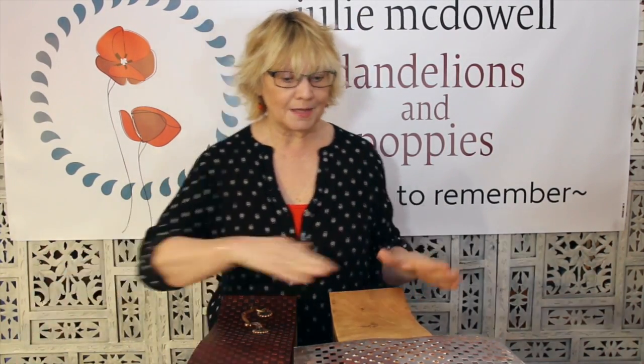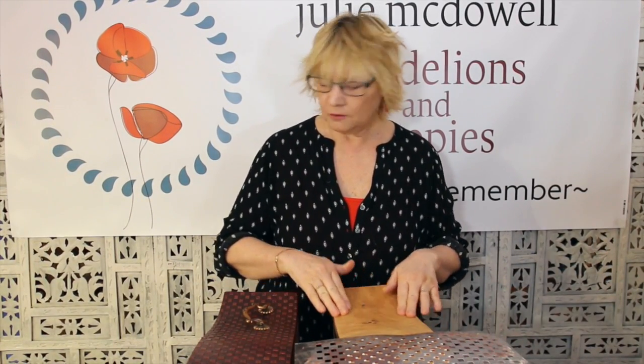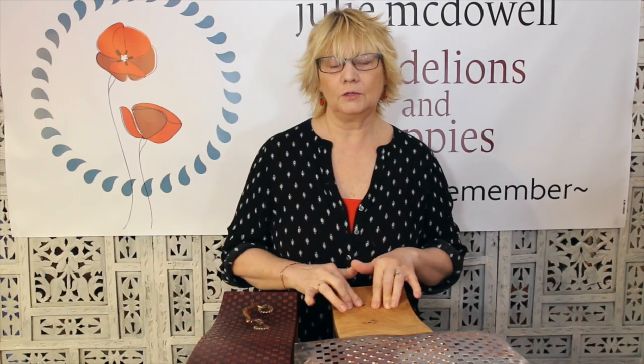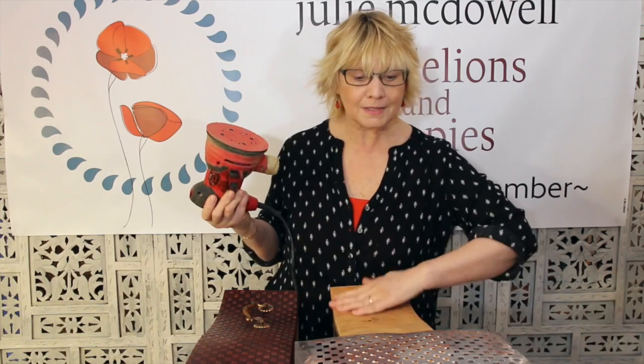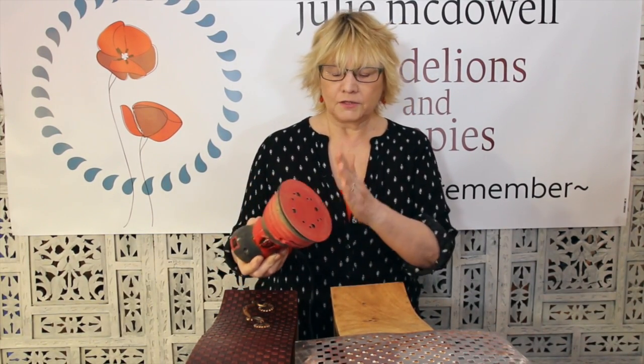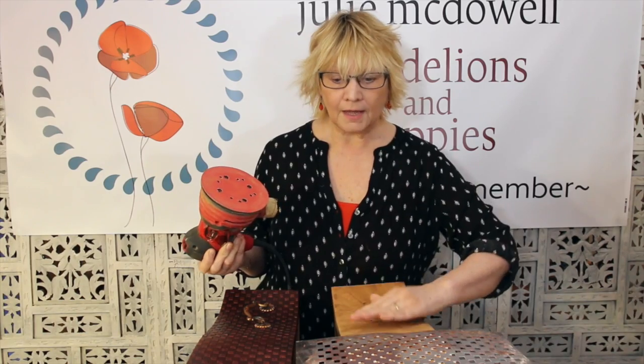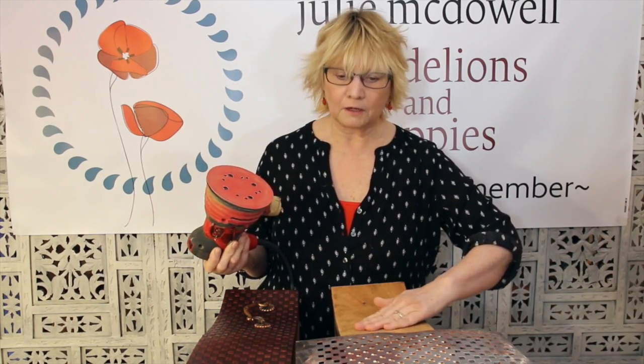Which would have been fine in this case because I'm going to be putting all sorts of stuff on. But if I was going to be staining this, I would have to be very careful. And if I was staining it, I would go up in grade on the sandpaper. Because although this is clean now, it does feel quite rough. So I would have gone up to 120 grit sandpaper very, very carefully. You'll feel straight away after you've done that the difference - it feels quite smooth. And then if you feel you need to go higher, you could go to a 220.